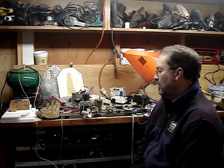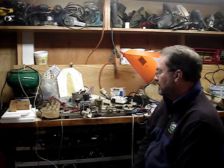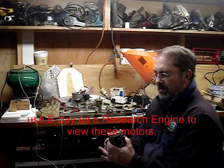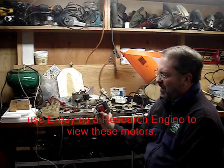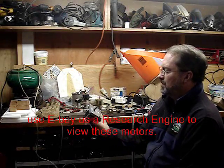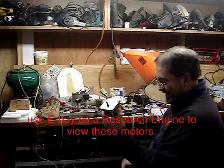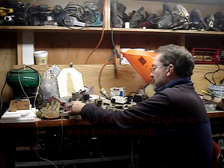The motors I found that were easily available were all somewhere between 10 and 100 RPM. One of the easiest to get was a motor out of a refrigerator. The particular motors I found were reasonably cheap, five to ten dollars a piece, and all rotated between 25 and 30 RPM — which is way too fast, but has plenty of power to do the work in the hopper.